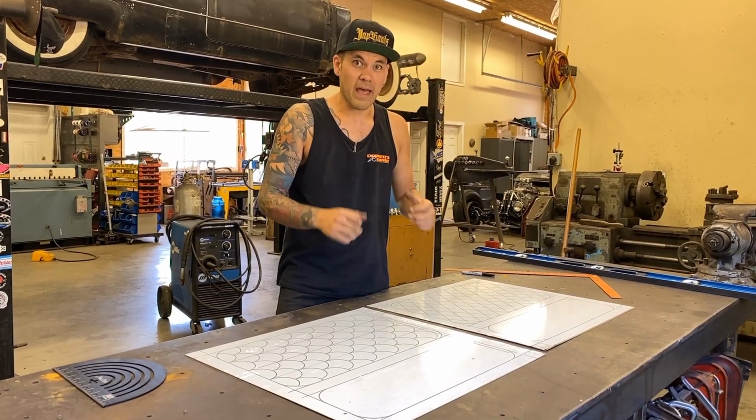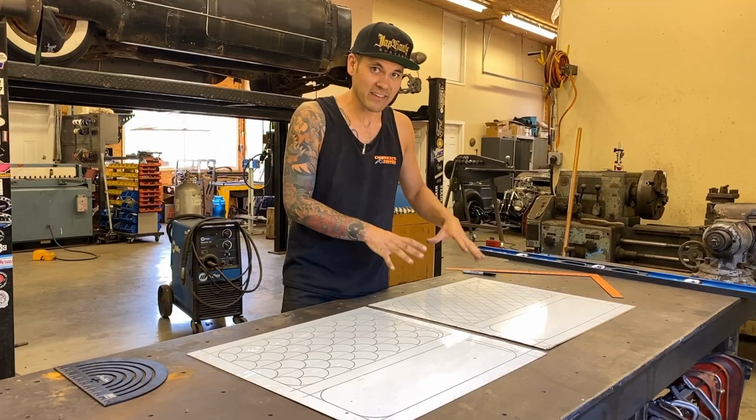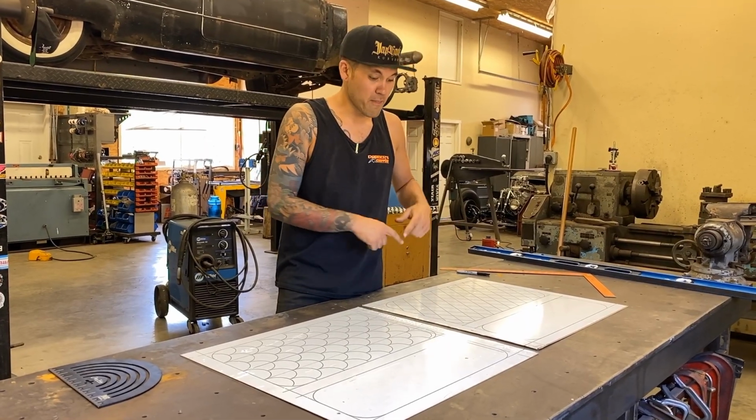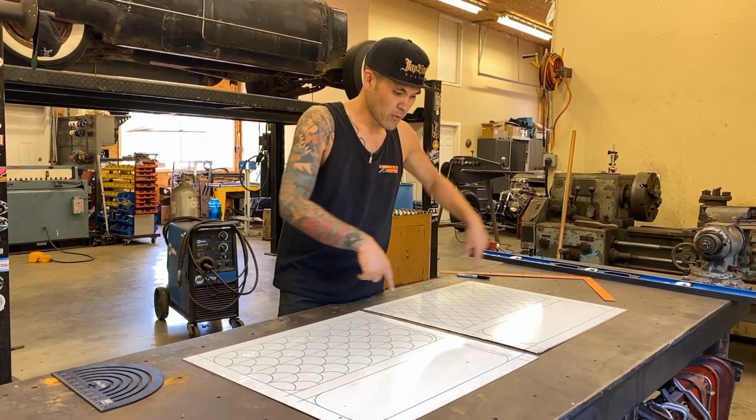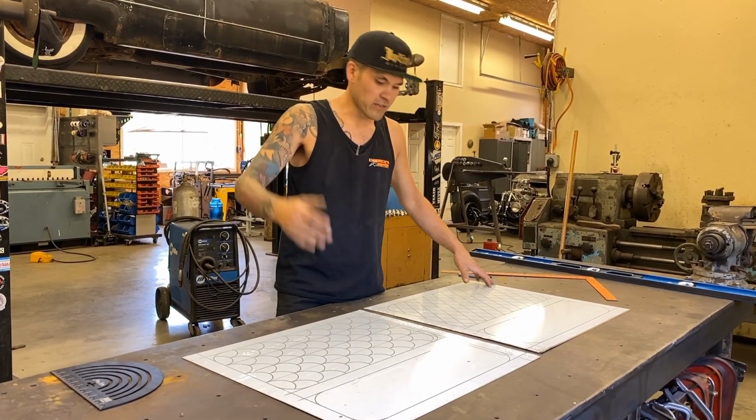When I bend the shape back, it actually puffs it up quite a bit, and it's nice because the panel is semi-relaxed after I've bent it all back. Then I want to lock that in with my step wheel around the outside. That's the way I do it. Other guys do it different ways.